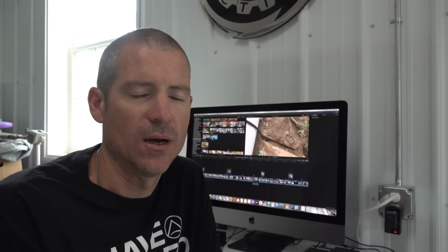Now, with that being said, the chances of all of these appliances running at full bore all at the same time are slim to none. It'll probably never happen. However, you're required to be able to run at the max BTUs of all your appliances added together. So the 2 psi system is what I've chosen to do, and I'll take you through that, and we'll just start at the tank.